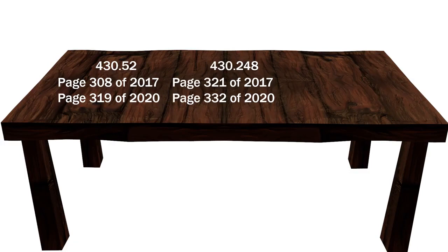The next table is 430.248 — on page 321 of the 2017 and page 332 of the 2020. This is where we learn to read our FLCs. We read the heading: 'Full Load Current in Amperes for Single Phase AC Motors.' On the left-hand side is horsepower; across the top, the black bold headings list your respective voltages. You come down with horsepower, slide over to voltage, and tee off — that gives you the FLC. What's really cool is that if you know any two values you can find the third: voltage and amperage give you horsepower, or horsepower and voltage give you amperage.